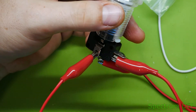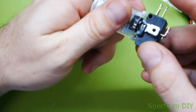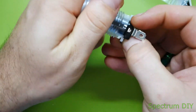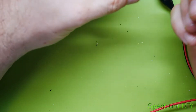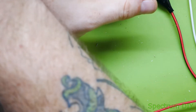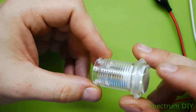The way I want this to work: I want the oscillator — since the oscillator in the circuit has an LED to ground — I want to take the ground and run it through the LED button depressor, so the LED will oscillate at the same frequency that the oscillator is oscillating. The next thing I wanted to cover is a teardown of this piece.